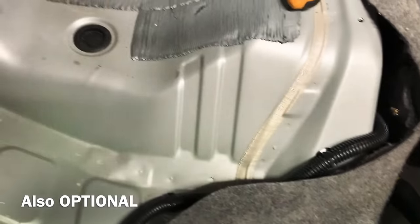On our platform, I realize I need extra support right here for when the door opens. So I'm taking a metal bracket and I'm going to go ahead and cut it and use that. Now I'm just going to sand them down because I don't want them to snag on anything. I'm going to pre-drill right through here into the wood and then secure it down. So we're drilling in our screws — one thing that's really important is that you're going to put pressure down and also hold the other side so the metal's not moving around when you put in your first screw. And now we have full support.